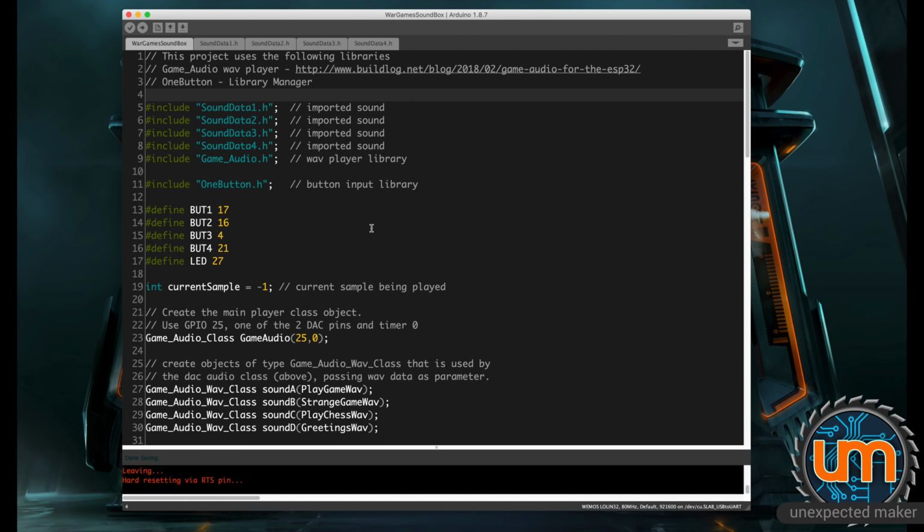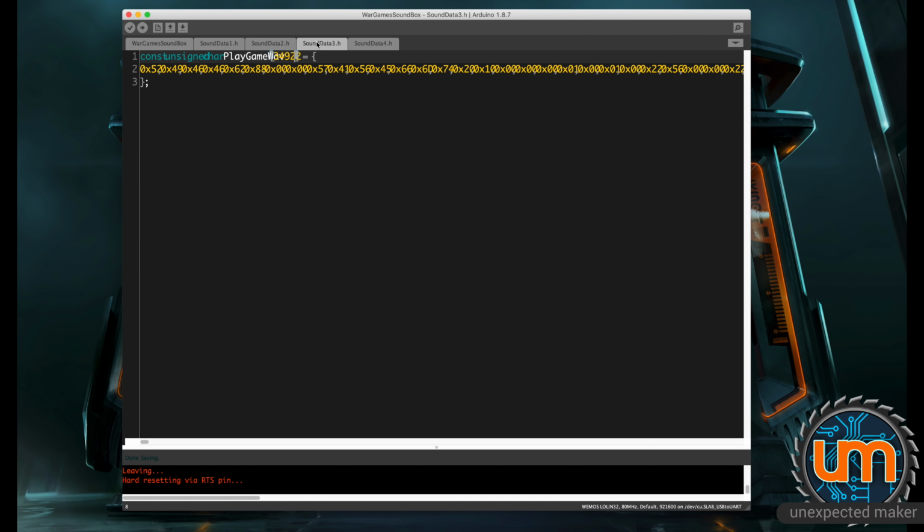Okay, it's time to have a look at the code. I'm using a library called Game Audio, which is a WAV player, which is available at this address up here. I will put this link in the description below. And it's basically a library that handles passing wave data in and playing the data on an ESP32. It's pretty cool. So I've got my four includes, sound data 1, 2, 3, and 4, which are these here. Bit of a funky formatting happening with the large fonts.